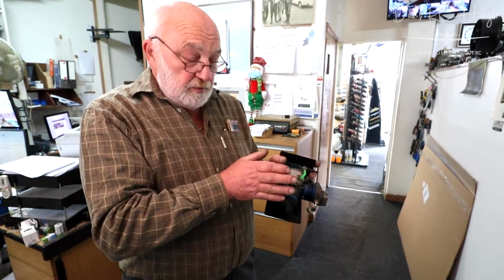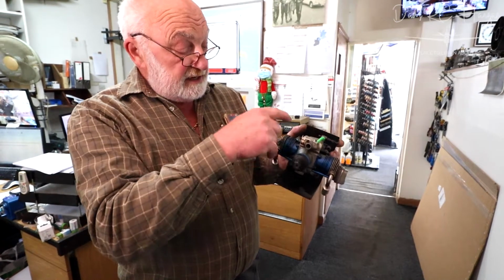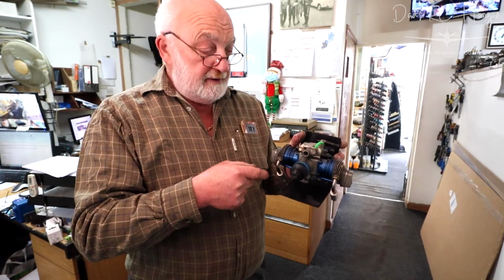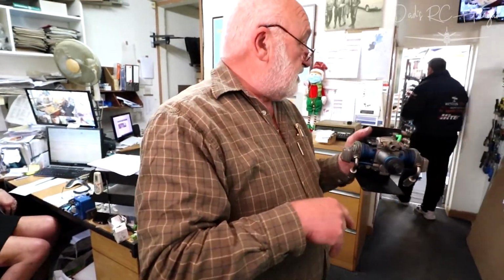You've got a major crankcase problem. Because when the pistons come out, on this one you're pulling in 1.6 cc's of air, then you're squashing it. So you have a very big crankcase vent, whereas if you induct into the crankcase, you now use that as a supercharger. Wow. So this has got reed induction into the crankcase.